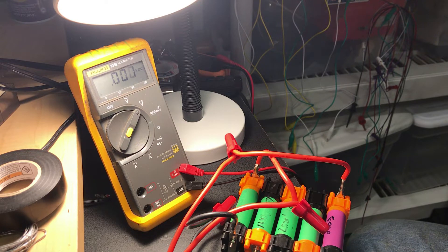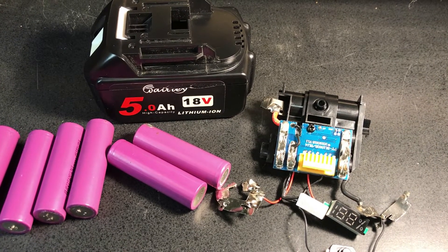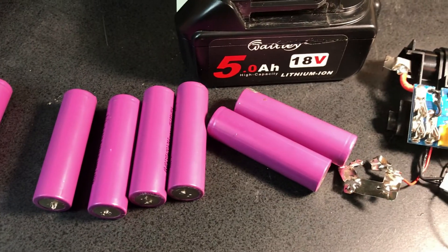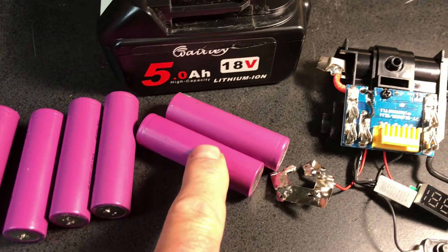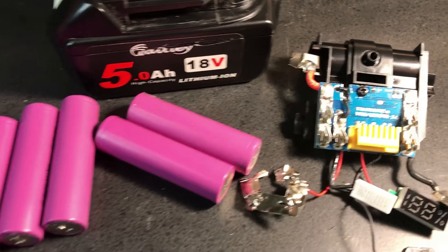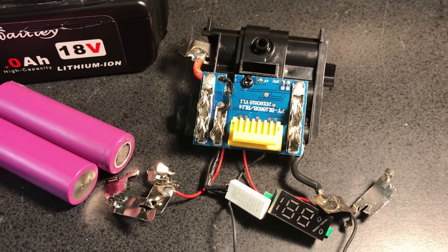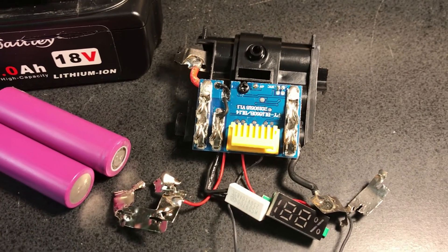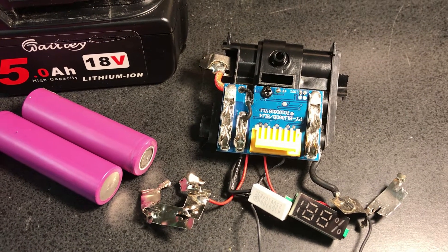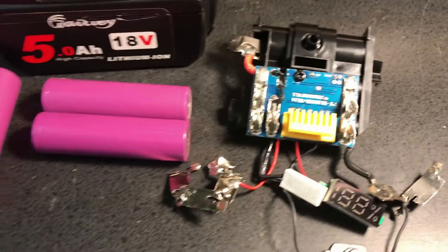You can see it didn't do a very good job of balancing. I took a knockoff Makita battery pack apart to find out why it failed — the results were interesting. Out of the ten cells in it, all but two have zero voltage, and the two still good are overcharged at almost 4.4 volts when the max should be 4.2. The BMS has no balance leads, so the charger puts 20 volts across all cells. In this 5s2p pack, if there's any difference in resistance between cells the voltages will vary — which seems very dangerous.